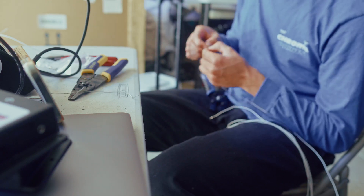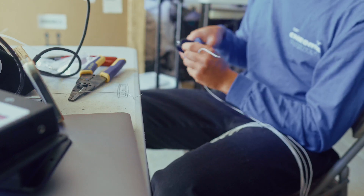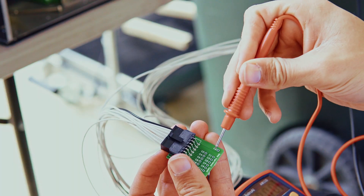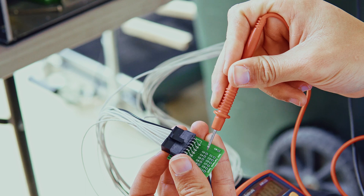After I replaced all the BMS boards, I went on to wiring the harnesses for each one of these LTCs. Along with the BMS, you'll receive a harness tester that you'll really want to use before you plug in any of these harnesses into the BMS — and I mean any time you plug them in. I hooked up the BMS the first time and I messed it up. That's something you've got to make sure you do: use the test board and test everything out. Don't be a dummy like me, but you kind of learn things the hard way sometimes. No matter how safe you're being, you can always make a mistake, so triple check everything.